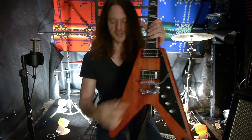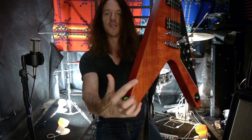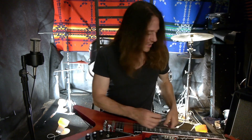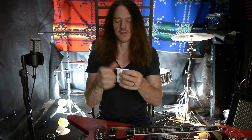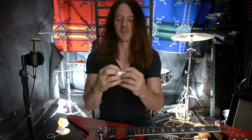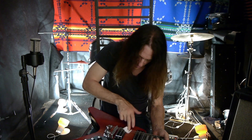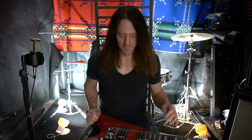I'm going to show you how to fix this little glitch. While I was in here I also bumped it, so I'll fix that little dot too. Mahogany is really soft wood, so now there's like this little ding where the finish is gone. I haven't done this yet, so let's see what happens. Whenever I apply stain, I cut out little four-inch squares of t-shirt. I think this works better than Q-tips or a paintbrush — I just roll it up and dab it on, back and forth. You could tape off the pickguard, but the stain wipes right off if it touches plastic.